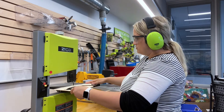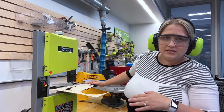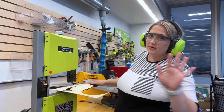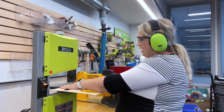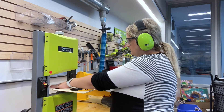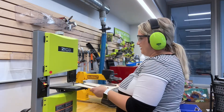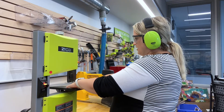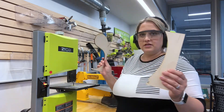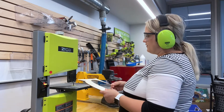I'm getting the wood set up close to the blade but not touching it. We want the blade to fully come up to speed before we start putting material into it. Machine on. I lay my hands flat on top — I want to be able to see all fingers and all thumbs while I'm working. I slowly push it through and hear a loud zing. It's a good thing I have my ear guards on. Fingers and thumbs on top, push it through to make the cut. I'll cut off this last part too — it's kind of sharp and I don't want to leave that stored in a bin.